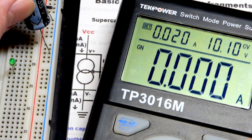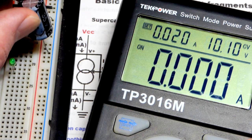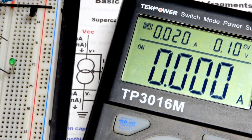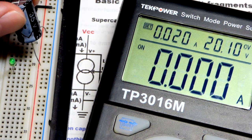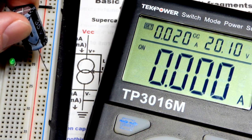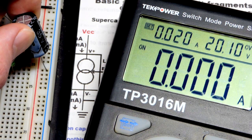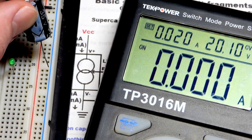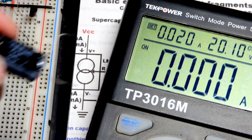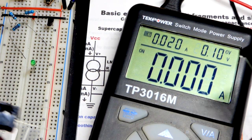It's better to discharge through a resistor. Watch this — you'll see a spark. Once I got a connection, there was a spark. We can go higher voltage to make it more dramatic. Positive to negative — we even got a spark; it charged. Now let's discharge it. Big spark! It will spark, but that doesn't really damage anything — maybe it vaporized a little bit of metal. We could use lower voltages to avoid those sparks.